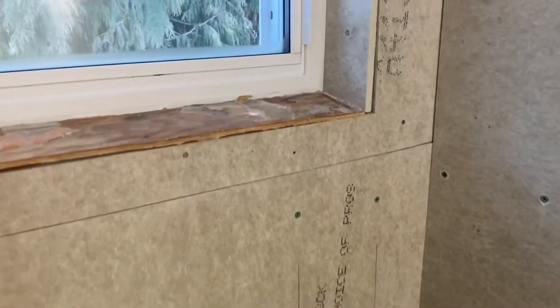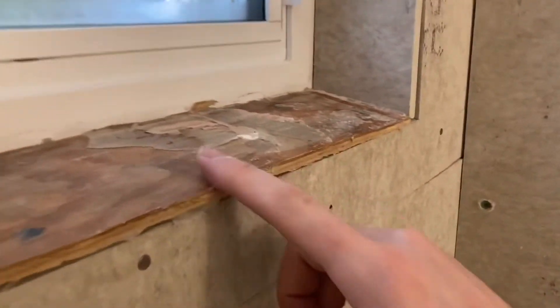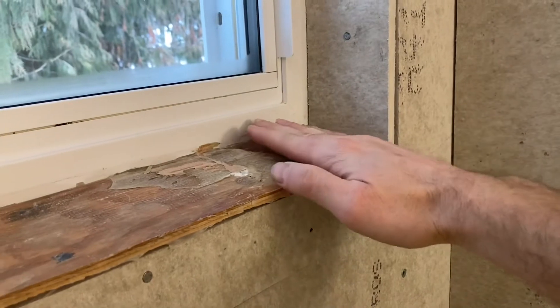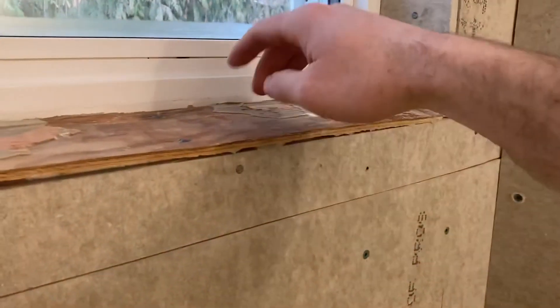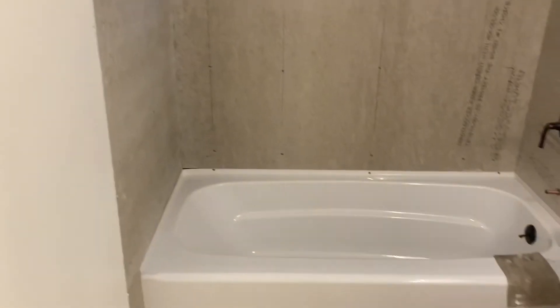The window sill is already there with the old material below. I'm going to waterproof this and chip off all the glue. It's already sloped about three degrees, which gives the water some shed ability. We'll bring the tile up and bring the top stone across so if water gets up here it'll flow off and not get into the window sill. We're also going to caulk and RedGuard this — RedGuard is like a waterproofing glue of sorts — and we'll show you how to do that in the next video.